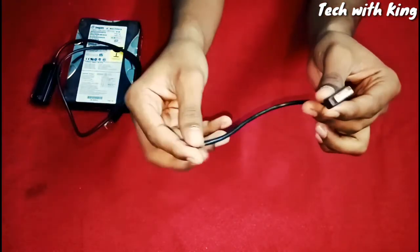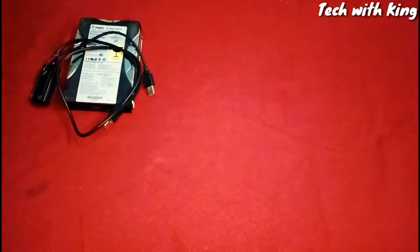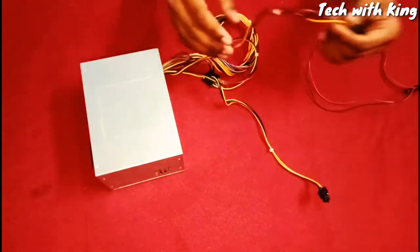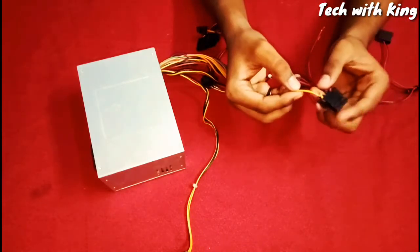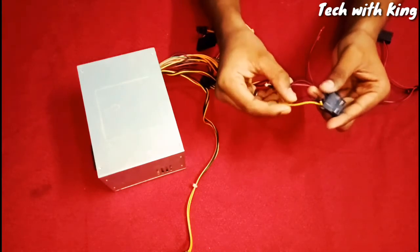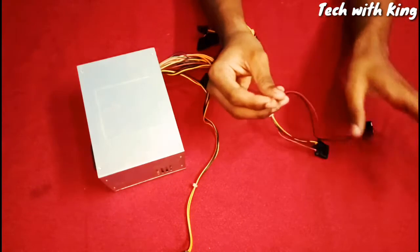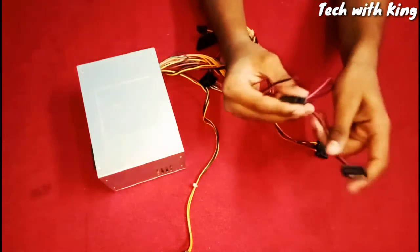We also need an old USB cable. I cut it out. From a piece of SMPS you have to identify the wires first — there are four cables. The manufacturer says the yellow wire is 12 volts, black wire is ground, red wire is 5 volts, and black wire is ground. I cut the 5-volt red wire and ground wire from the SMPS.